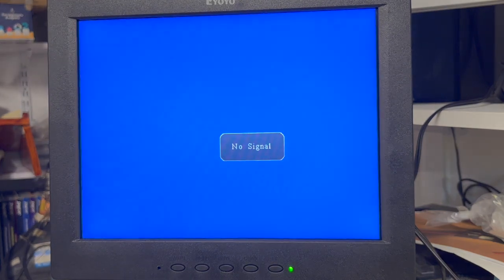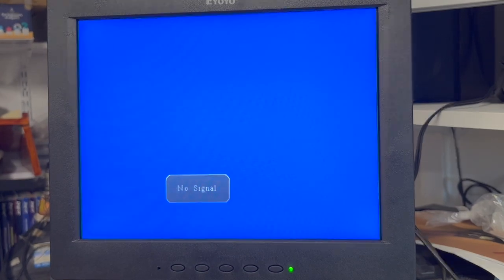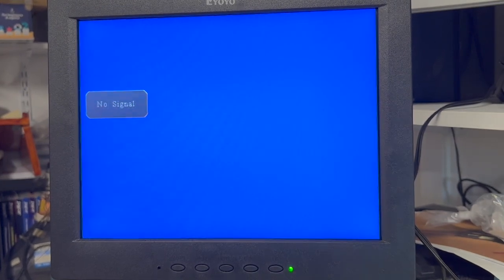So the 1869, the 1869 generates horizontal sync display, active low, which goes into the 1870, which does the actual display. Swap that. Let me pause. Okay, interesting. So I'm adjusting the video level. I've swapped the 1869 chip. Adjusting the video level.